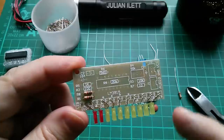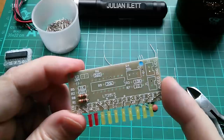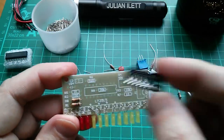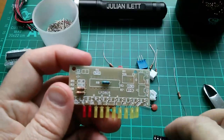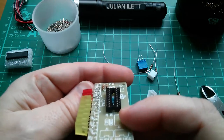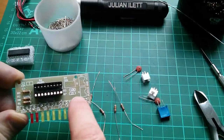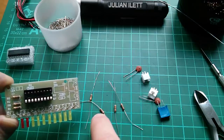The LM3915 datasheet states that LED current drive is regulated and programmable, eliminating the need for current limiting resistors — so those two 1k resistors on the red LEDs must just be for brightness matching. I've fitted them because I'm building this circuit exactly as laid out. I also need to find a circuit diagram. There's a 20k resistor that fits down the little gap in the middle of the IC socket — an interesting positional choice. The socket fits over the top with a click, with a slight bow.